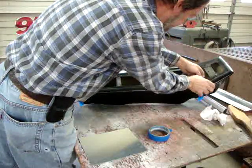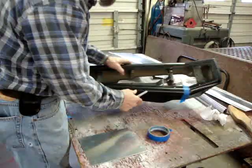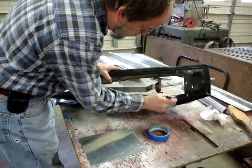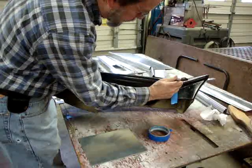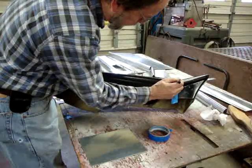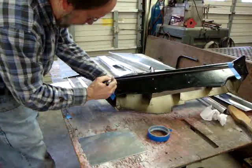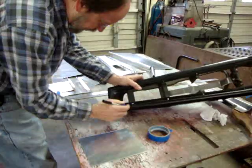Go ahead and cut them off the edge flush with where I first marked. I'm just going to mark the major bends. I'm right down in the bottom here, so I take my Sharpie and run right down in that groove. I'm going to come right across the top here — this will be my second bend. It gets rolled around here but there is a major bend right at this point. Right here on the top of that bend I'm going to make a mark. Then again it bends back out here in the bottom, so we mark that point on both ends — our major and minor points of the profile.